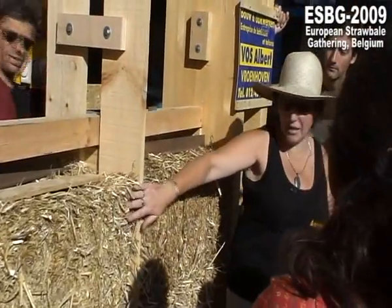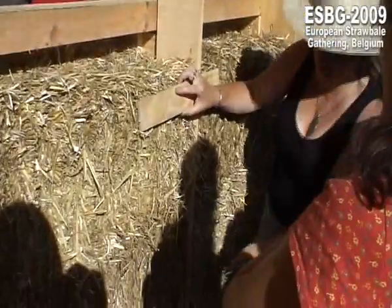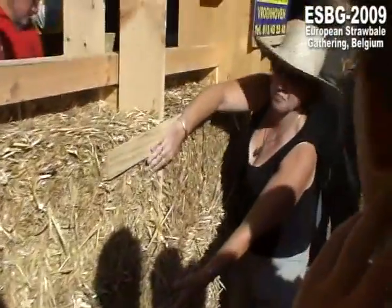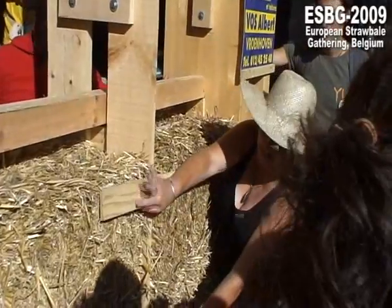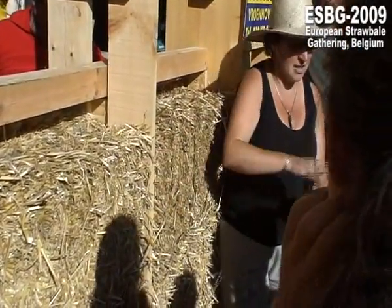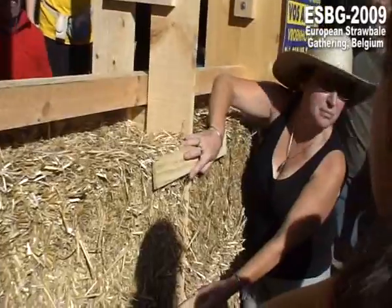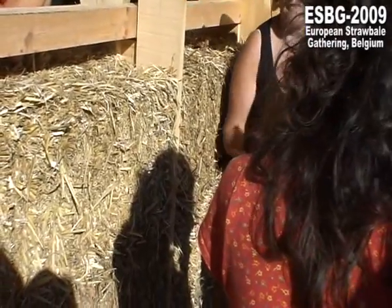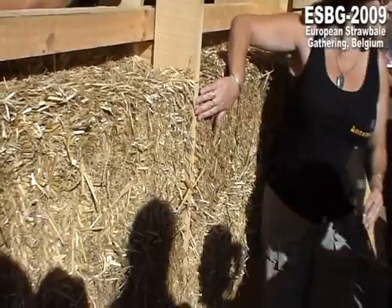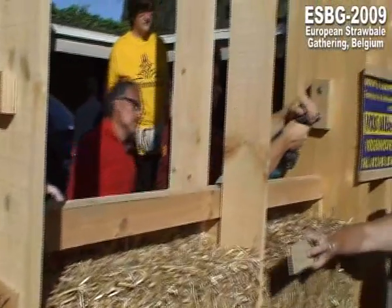So in our house, we've put some wood bars on it, like this, and then one over here, every 40 centimeters. We put clay in between to get it even. The clay, the puts in between to get this even, and then we put the wood on top of it. So fire protection. Yeah, you've got fire protection by the clay, and you got wood for the external. That's nice of this system that these posts in between can use.